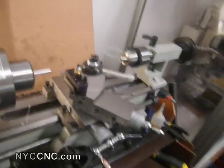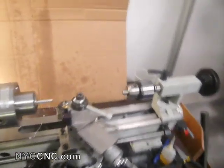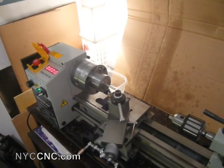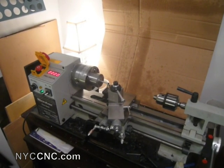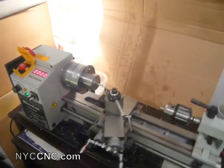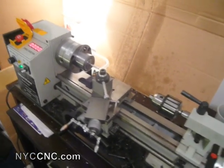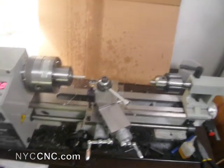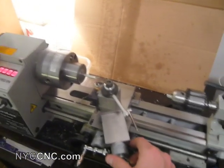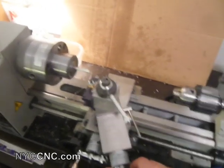Astute viewers will notice I've also moved the compound slide back about seven-eighths of an inch, which is a recommendation they make in the plans — you don't have to do that. It's a great project and a demanding project. Even though it's technical and a little complicated, there are a lot of parts to be made where if you screw up one thing, you don't have dozens of hours in one part. I took a couple of weeks working nights to make it, but it's not that hard and not that many things. I like it because it helps me adjust between my 30-degree angle for single-point threading, or move it to 60 degrees to use simple trigonometry — move the compound in one thou and get a half-thou adjustment — and also rotate it all the way to 90 degrees so you can have fine feed on your depth.